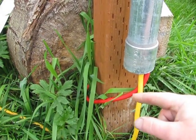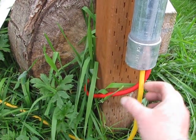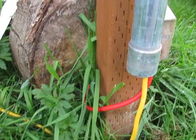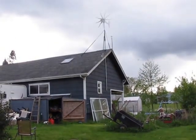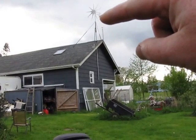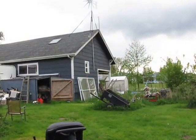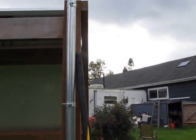Or I could just unhook it and bypass it until I can replace it. So I think I'm going to get an outdoor electrical box, drill a hole, put the slip ring in and attach it to the top of the box, and hook the wires to it. So when the wires are moving back and forth with the turbine, they'll actually be turning the top of the slip ring. That way I can change it, because that pole takes three people to take it down — one person up top to unhook all of the bracing, and two people down below to loosen the mounts holding it to the wall and slide the pole down, because the pole actually goes through the roof.